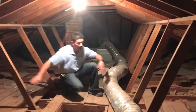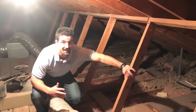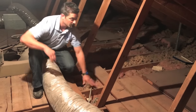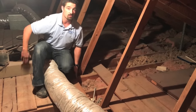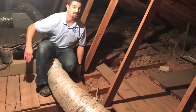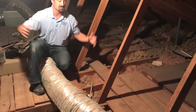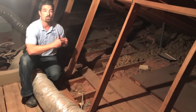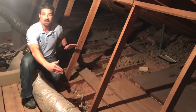Going on to this next one — same thing. This is that other side of the hallway where we decided, are both walls bearing? The ceiling joists are cut, and not only that, they're actually cut all the way through here. The rafters are also bearing on this. So yes, that's the load I'm going to have to calculate — what kind of beam do I need to be able to support all this weight so that it spans over your opening?